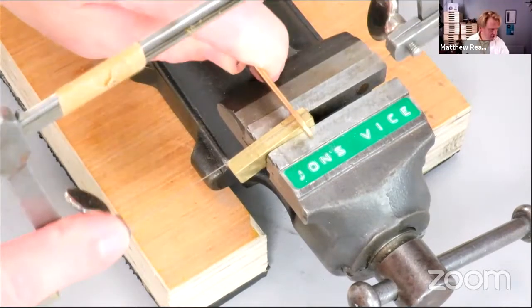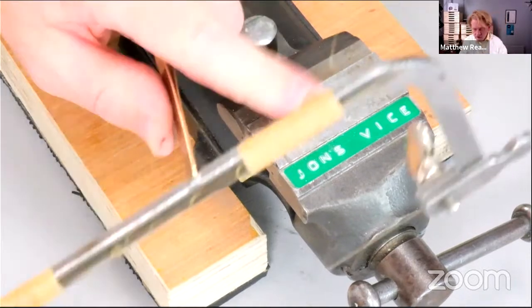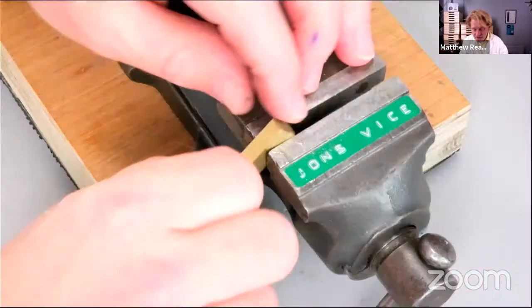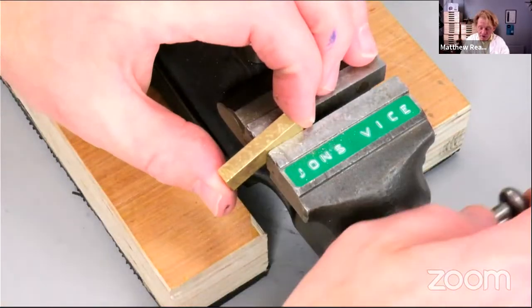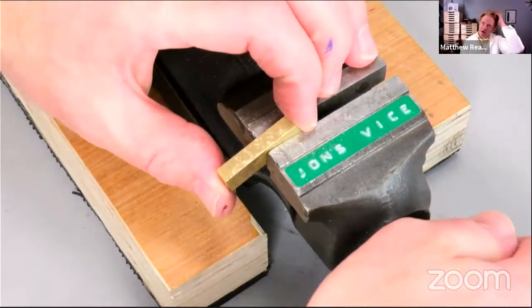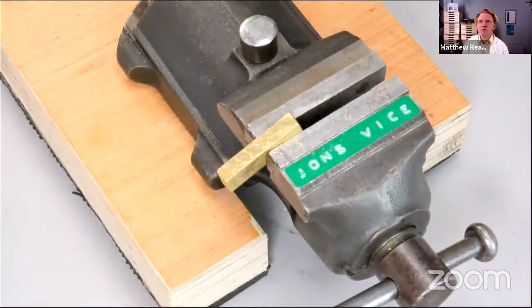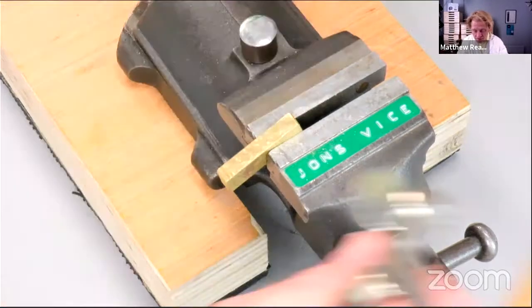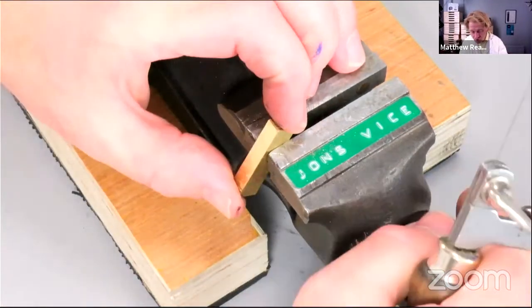I bet Ian has got circular saw blades for his lathe, which are great, really, really useful. Circular saw blades are so cool because when you're making those kind of escape wheels that need two cuts, rather than making some fancy shaped cutter, you can normally hack most of the material out that way. So I really should concentrate more on this.